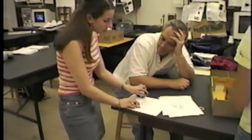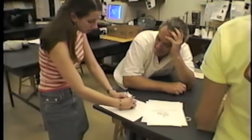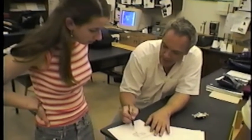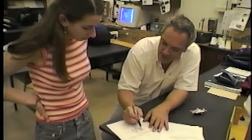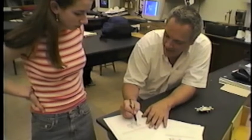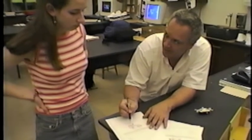So, okay, electricity goes from the source, and then it travels to here. So let's look at it right now. Right now, electricity would flow that way. Okay, so the light would actually be on. If I move this switch so that it disconnects here and connects here, it's still disconnected here. I've just turned off the light. Or I could do that on the other side, and that would disconnect the light. But if both switches are in the other position, then connect, connect, connect, connect, light on again. That's what's going on. Okay. All right, I get it.